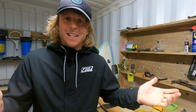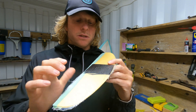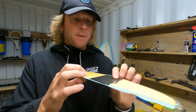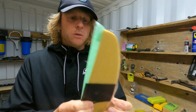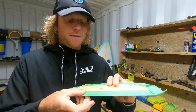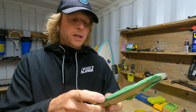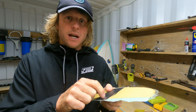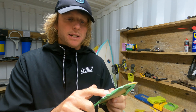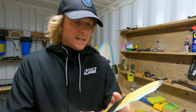So let's get into it. Yesterday we finished our lamination — you can see that the fiberglass has gone hard now. That all looks really good; there's no air bubbles and I'm happy with the way that it's laid up. You can actually do the hole filling as soon as this lamination feels hard enough that you could rest it on a surface without damaging the fiberglass. It needs to be reasonably hard but you don't need to wait a full 24 hours to move on.